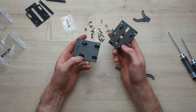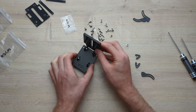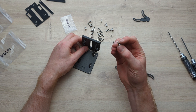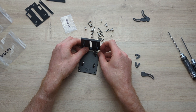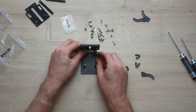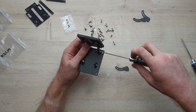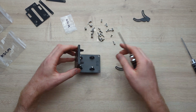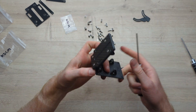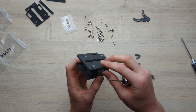Now we're going to put these two halves together, going from the back first. This just slides in here, then we use the same M3 by 10 socket screw with a washer and put that in here — it should be a reasonably tight fit to keep it all secure. Use a 2.5mm driver to secure that in, and then the same thing on the other side. You don't need to tighten those all the way down, as that gives the hinge in the back so it can move around.